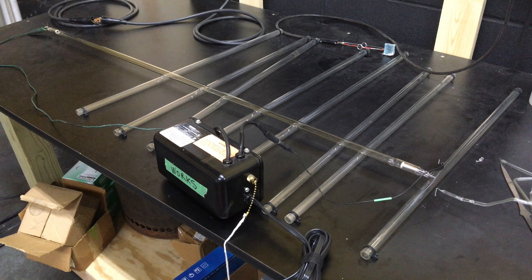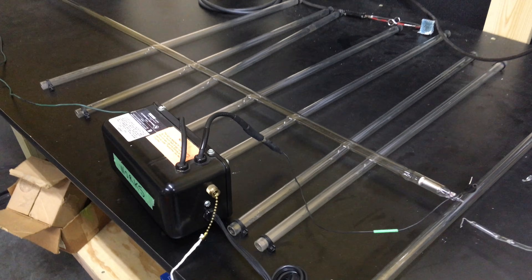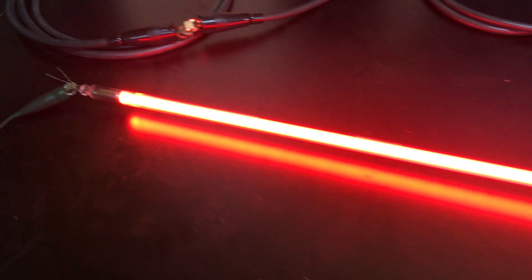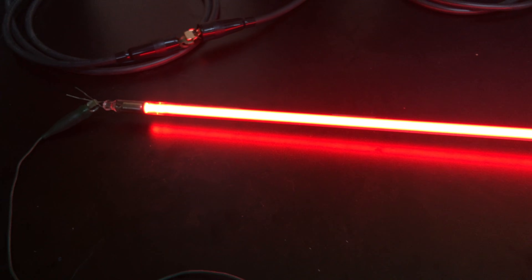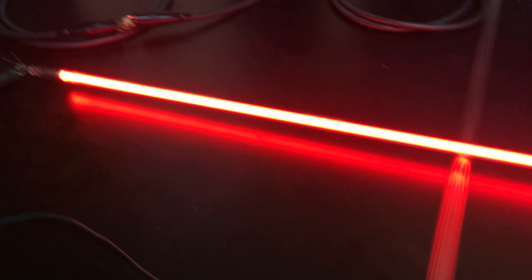Alright, I turned off the air blower. The pump is quiet enough for me to talk over it. We got the tube hooked up to a transformer, and this is the moment of truth. Let's see what happens — 3, 2, 1. Wow, that's awesome. That is perfect. That is exactly the color we want with no snaking. The camera sensor doesn't quite pick it up right — the reflection you see on the table is kind of the color it is. The sensor is getting bleached out by the intensity of the light. But we got that reddish orange classic neon glow. That is most excellent. No snaking.